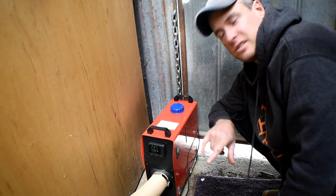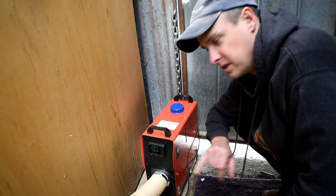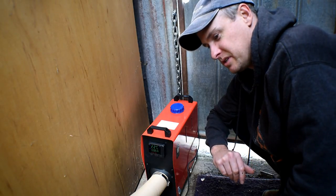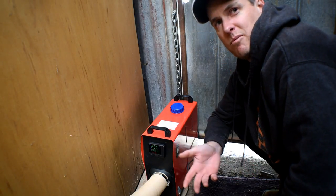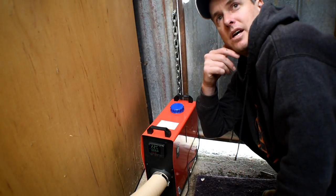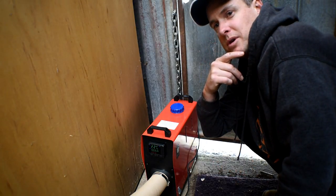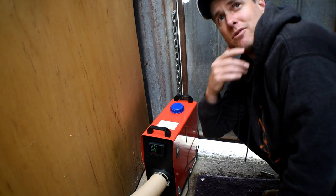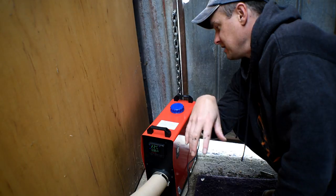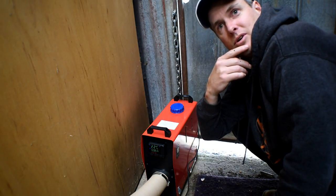That's taken us nearly an hour, with the temperature set at 22 degrees Celsius, to get the shed up to a respectable 19 degrees Celsius. Granted, it's only come from 15 and it's not an overly cold day today, but I'd say the internal cubic meterage of this shed would probably be about 120 cubic meters. So it's a fair-sized shed, and it's done a respectable job to get the temperature up to 19 in here.